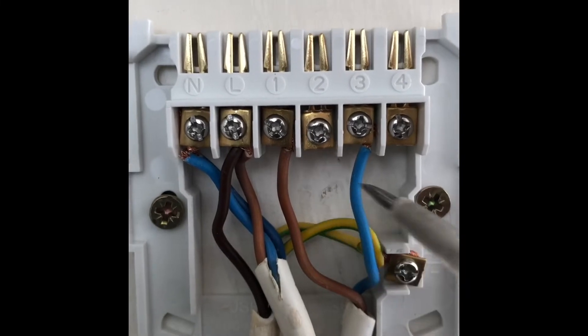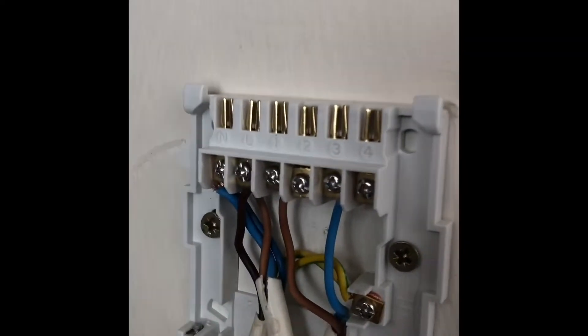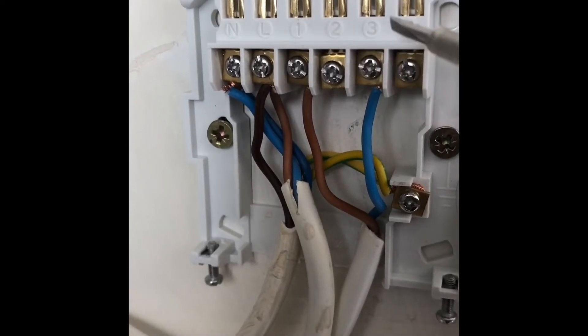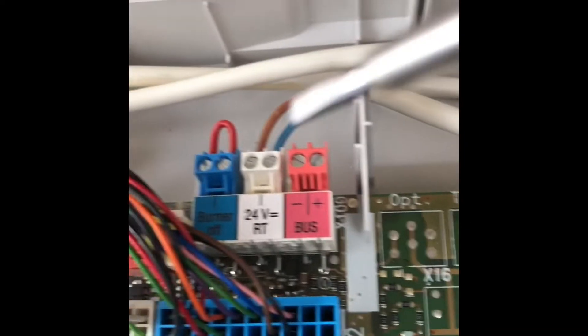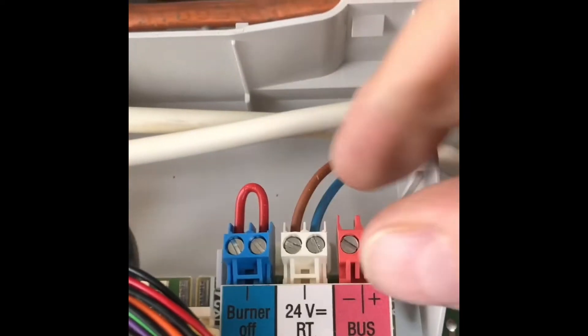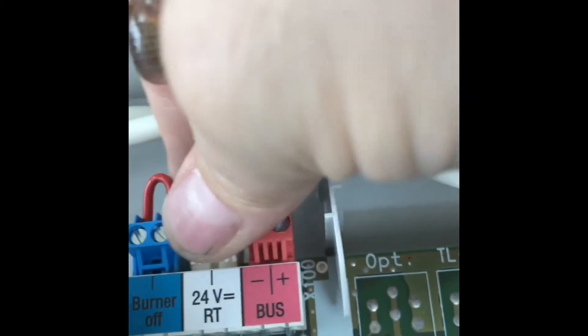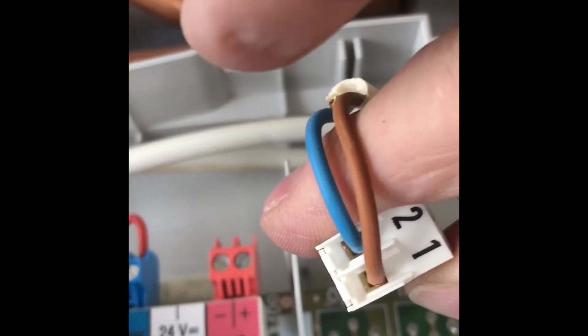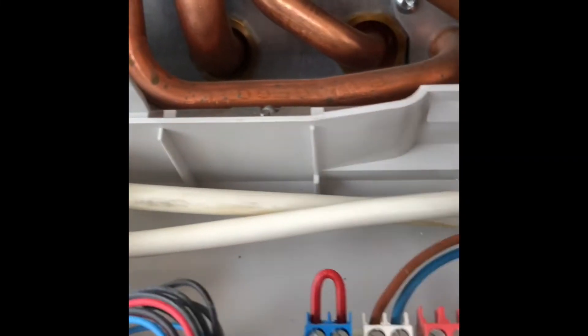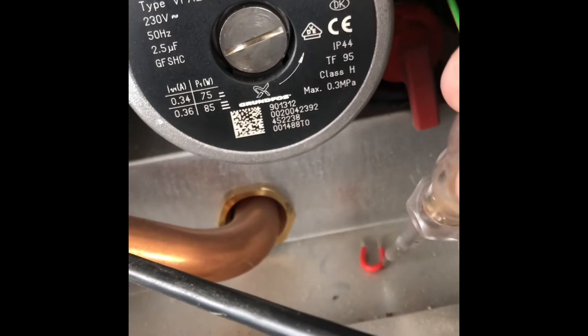I'll show you exactly where these two wires are going to be situated on the boiler. Opening up the panel — we've got the brown and the blue, which are common number one and number three. They go into here. As you can see, we've got brown on the left and blue on the right. If you grab hold of these you can just pull the whole plug out, which enables you to put the cables in and screw them in, making it a lot easier. Then once you're done you push that plug back in. There shouldn't be a bridge connector — I've taken the bridge connector out and left it in the tray there.